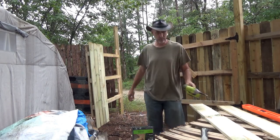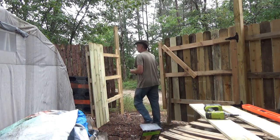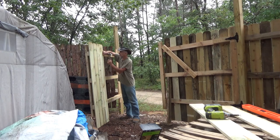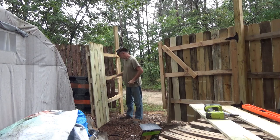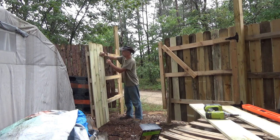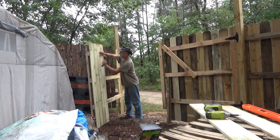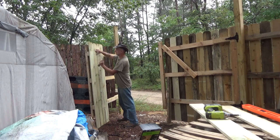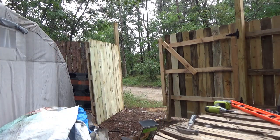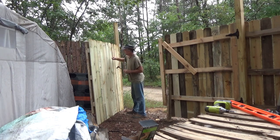The land slopes up sharply here, so I'm going to have some work to do straightening out the land so I can open this gate all the way. Now here in this case I'm leveling, and then putting a couple boards and nailing right away so that it will hold up and not sag. I got the interior cross brace on, and the boards themselves will prevent sag quite a bit — same as when you're building a house. They'll help hold a lot of their own weight when they get all these nails in. Now I'm down to just nailing. This one's sitting on the ground so it can't sag — that helps for now.